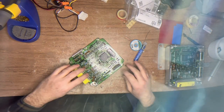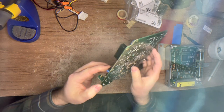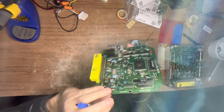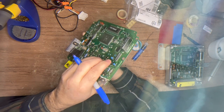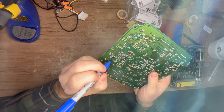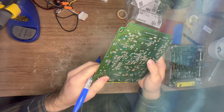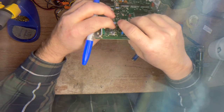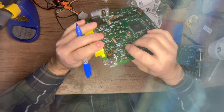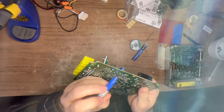Let's replace the 220µF/10V first. We're going to flip the board around. One other tool you'll want - look at the capacitor you need to remove, line up the other side to get the correct terminals, and mark them off with a permanent marker. That way you can flip the board and do your solder work. You desolder them from the back. I'm going to mark off each one - that way you don't desolder the wrong stuff.